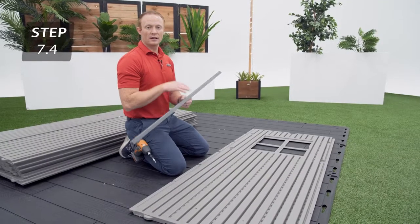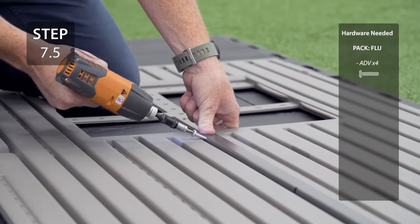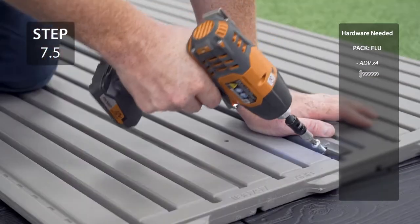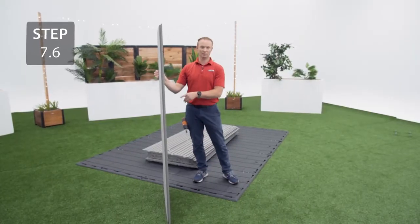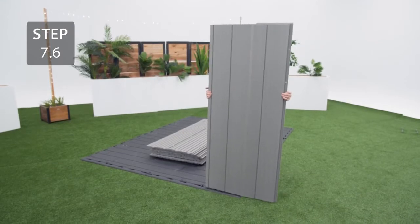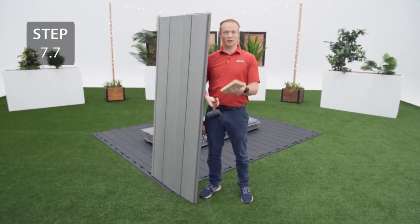On the window wall panel, add the short wall support to the center channel. Secure the wall support to the wall panel — you will need to insert the hardware at an angle. To the left of this bushing, insert the tabs at the bottom of the corner wall panel labeled AGY into the slots. Slide the wall panel over to lock into place. I'm comfortable kicking the wall panel over with my foot — if you're not, use a block of wood and a rubber mallet.